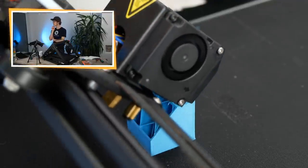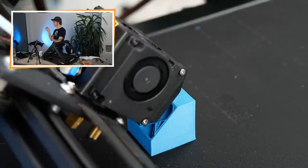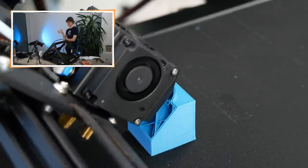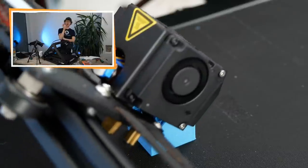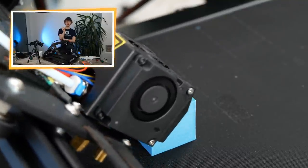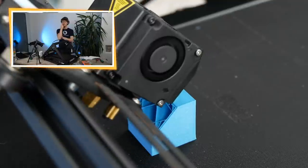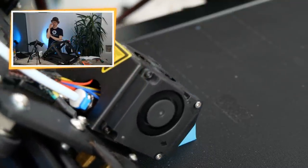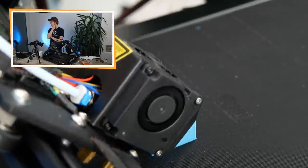Scott is just saying the new M808 G-code command should do the trick for repeated printing once people get used to it. I don't know how it works yet, but this might be something cool. It might also give you the possibility, if you have a printer with a print platform that nicely releases a print when it cools down, to use your print head to knock the print off the platform and even use a normal Cartesian 3D printer for repeated 3D printing, which might not be as reliable as such a system, but would still give you that option maybe in the future.